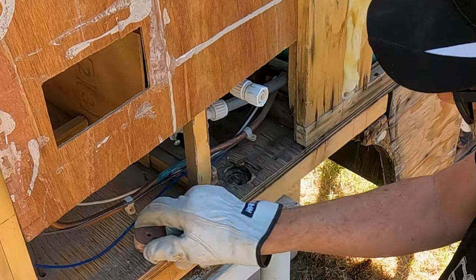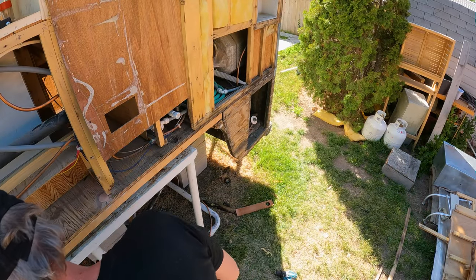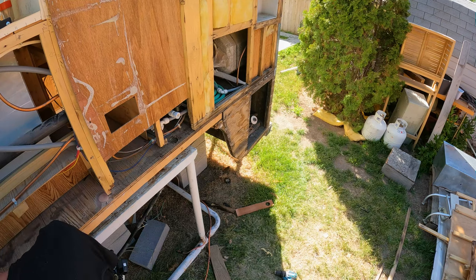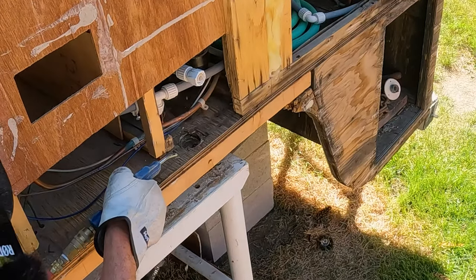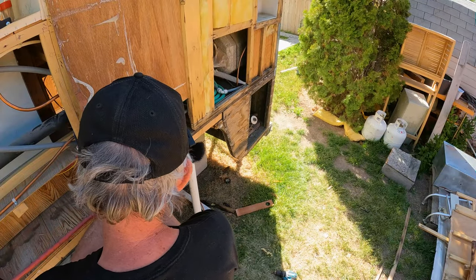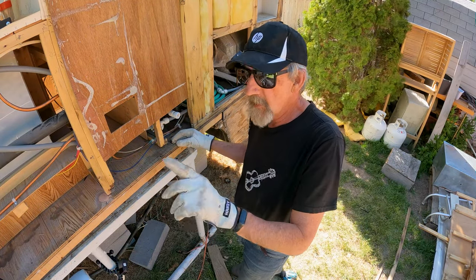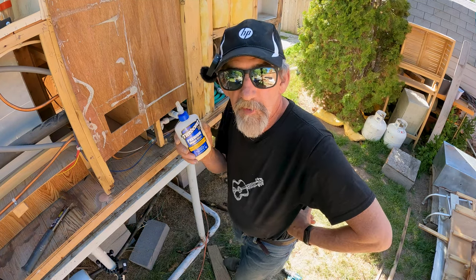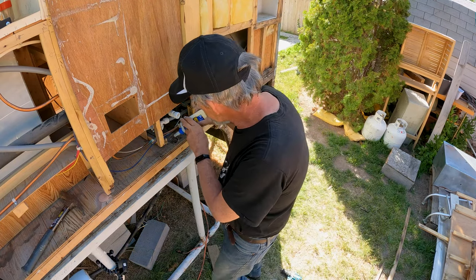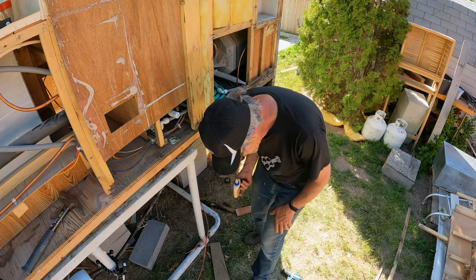There's some garbage in that hole, so I'm going to get that out of there. We'll get this glued in, then we'll have to wait a minute to drill this one, but we'll do the others real quick. Just a little bit of your favorite exterior-rated glue — you could use construction adhesive if you have a mind to, but this will work just for me.